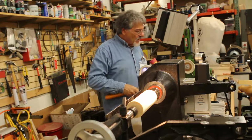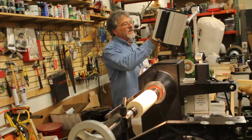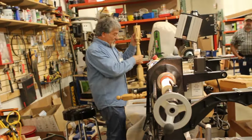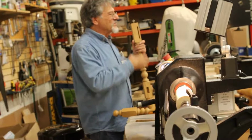Maybe I should just say quickly about it. Let's see, how about this one? This is a very typical table leg. This is the kind of table leg you use on a gate leg table or any table that has a bottom stretcher. Right, because you got a square down here to attach the bottom stretcher. You got the square up here to attach the apron. You know, this is what gets mortised. How many of you have done any furniture or are interested in doing furniture? Right, so this top square is where you put your mortise, and that's where the apron attaches. Okay. Down here, why is this mortise in the center? Because this table had an H stretcher. Right? So one coming up here and then another.